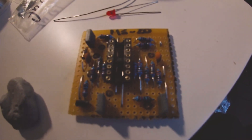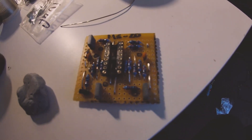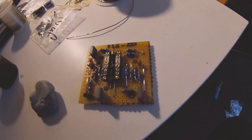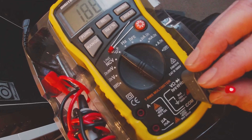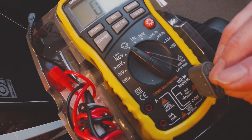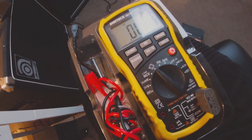Let's see how this goes. I've got all my resistors in, a couple of capacitors. I'm now going to put in the two red LED diodes. A bit like clipping, I guess. I've got 3mm LEDs for this one. Just a tip — use a multimeter before you put them in your circuit. Make sure they work. Select diode on your function and stick them in. They'll light up. Make sure they both light up because a lot of these little LEDs can be dead sometimes. That one's lighting up, so I know they're good to go.